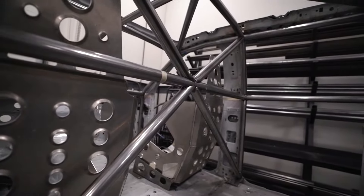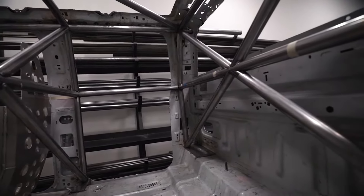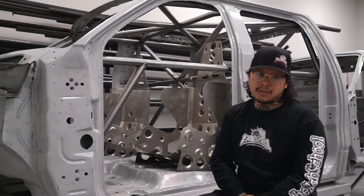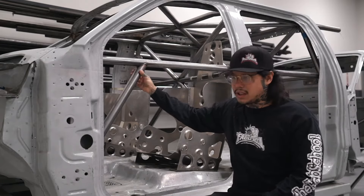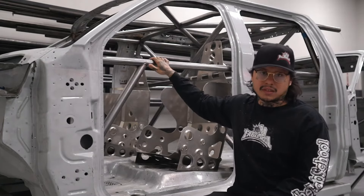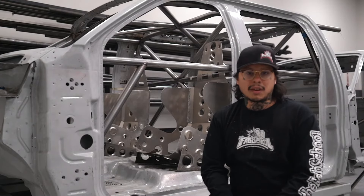There were a lot of other fundamentals that we learned about that I hadn't thought about — basically some principles of tube continuity. Pretty much just making sure that these tubes line up, that the centerlines of these tubes line up, so it looks nice and so it's nice and strong with a lot of structural integrity. Big learning process, but in the end I was pretty happy with how it came out.